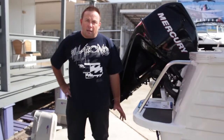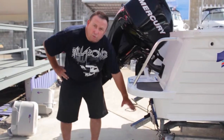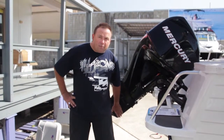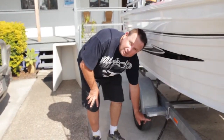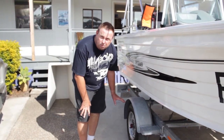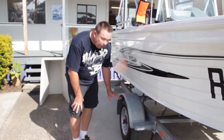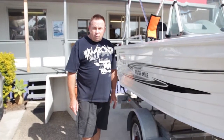When you back the trailer down, make sure it's deep enough that it doesn't snap the transducer off - it's going to cost you money. Here's a good indicator on this particular trailer - I always like to use the rear supporting skids. I like to back the trailer down just so they're touching the water, so the boat's deep enough it won't damage any of your transducer brackets or hit the bottom of the outboard. Another good indicator is towards the front where the wheels are - we have a front step, and I always like to have that about an inch above the water. People worry about putting the bearings in the water, but bearings and trailer lights are just consumables and part of your pre-boating checks. I'd rather replace a set of bearings annually than damage the boat by not putting it in deep enough.